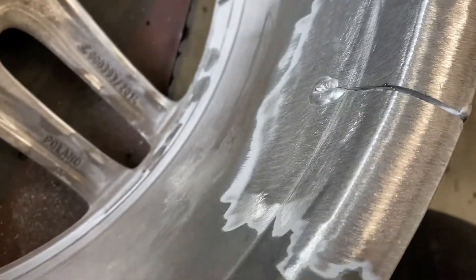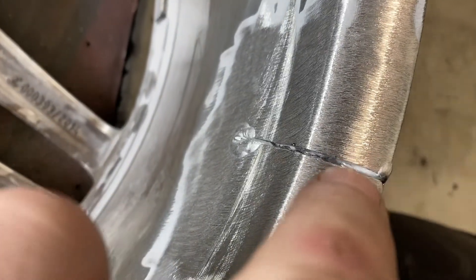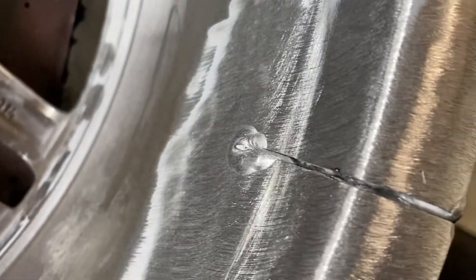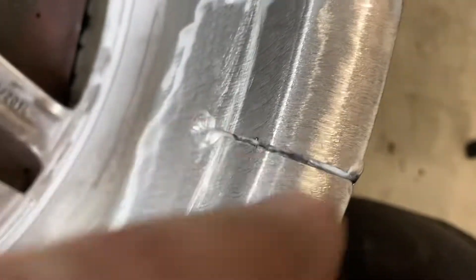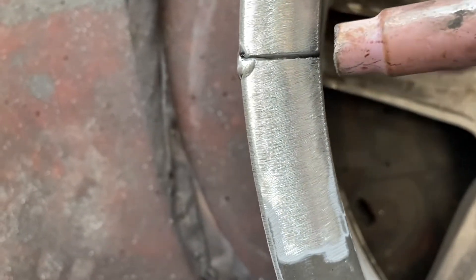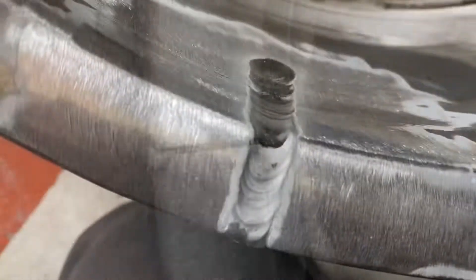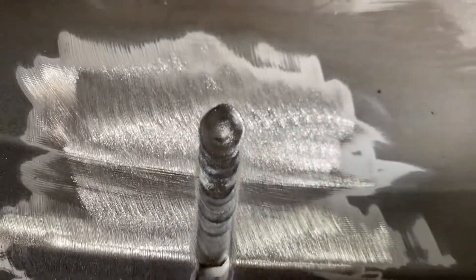What I'm going to do is leave the welder turned up and I'm not going to add any metal — I'm going to weld the outside to the inside. You can see that's got quite a deep gouge in it. I'm just going to go over it with the welding torch without adding any filler rod. I'm going to burn it right through until we've got something like this.